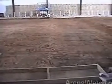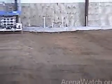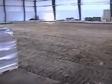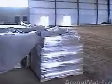This is a sand base installation with a permapipe system. The overall elevation decreases 9.5 inches. At the point where the header is located, we actually excavate the rough grade down to 19.5 inches, as you can see right here. Please consult with all Burley Rink Supply drawings and engineering specifications for your particular project, as design may modify these elevations that I give you.